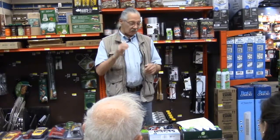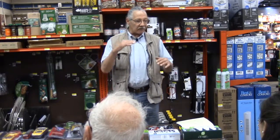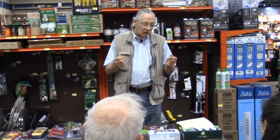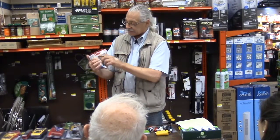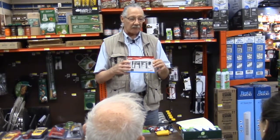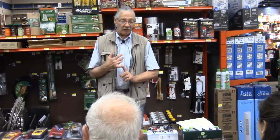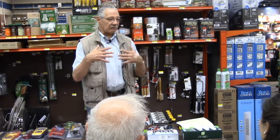So you're going to run 600-watt incandescent or 150 or 300-watt LED. That's actual wattage of the LED compared to actual wattage of the incandescent. And again, CFLs — if the package doesn't say dimmable, it's not. Don't try and dim them. One of two things would happen: you're either going to burn out your dimmer or burn out the bulb. They're not compatible.